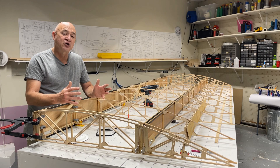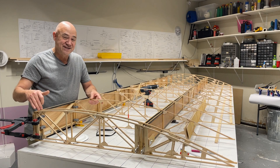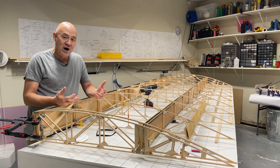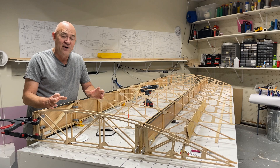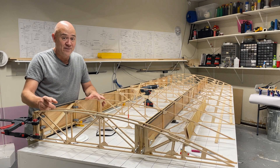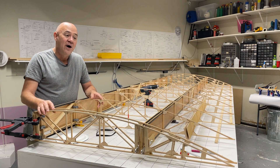I'm talking about structural epoxy — not five-minute stuff, which I think is worse than CA. Thirty-minute epoxy is okay. This epoxy takes about six hours just to set up and 48 hours to completely cure, but by then it's really soaked into the wood. Wood glues will soak in, but where there's no oxygen they just don't seem to set up as quickly. When this was available as a kit, it came with structural epoxy, not wood glues. And when I did a poll on my Facebook page, 92 percent said they use structural epoxy for experimental aircraft over wood glue. In my testing, epoxy was only about seven percent heavier per six-by-six inches than wood glue.